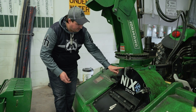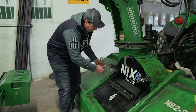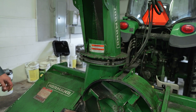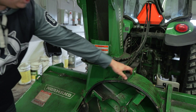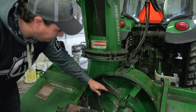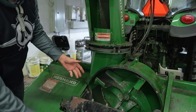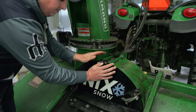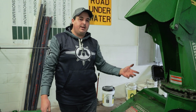We're going to show you how to open up the back of the hatch here if you're ever clogged up. Take out your safety pins and then all these latches — it just opens up. About 60% of your plug-ups are going to end up just being heavy, wet snow right in this top area here. We have this little shovel, and we usually just scoop out as much as we can from the top, then try and push the rest of it down into the bottom area where it's a lot easier — you can get your shovel in there, bring it down to the bottom, and scoop it right out. Once that's all cleared, close her back up again, then jump in the tractor and see if you're unplugged so you can continue with your snow blowing.